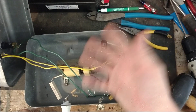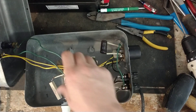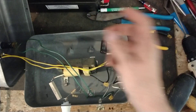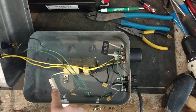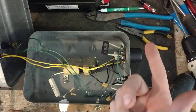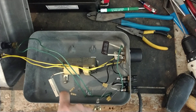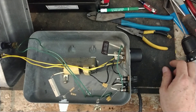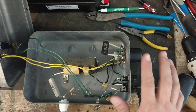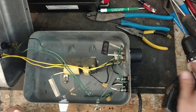There's the transformer, which takes the voltage in and spikes it up, putting it out to your fence and ground terminals. There are some resistors to help with limiting the power going to the bulbs. This big power resistor here is a 30K 10-watt resistor — 30,000 ohm, 10-watt — that goes between the output of the transformer hot side and the hot terminal. It's what limits the power output from the transformer so it's at a safe shock level so it won't hurt anybody.